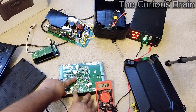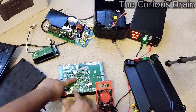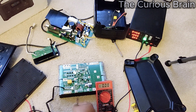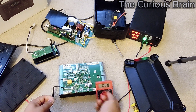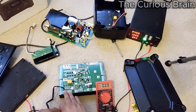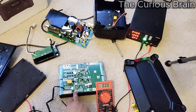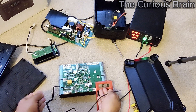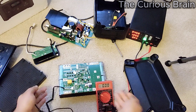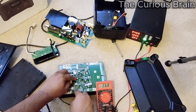That would require a lot more work — I'd have to literally rip off the back side — but I'm just going to show you this fix. If you don't have any bad cells it's possible the jump-start will work and it'll charge like normal. I purchased this on eBay for 50 bucks, so it's possible there was an original issue with one cell. Because of one or two bad cells it's draining all the power. Look — 2.68 volts on that segment. All the others: two-to-three is 4.08, three-to-four 4.08, four-to-five 4.08, five-to-six 4.08, six-to-seven 4.08, seven-to-eight 4.08. The problem is clearly in that same segment.